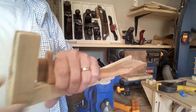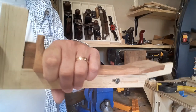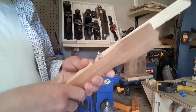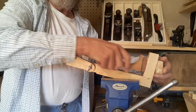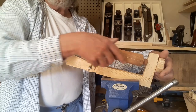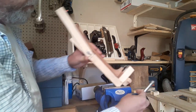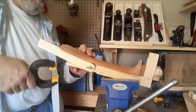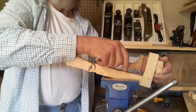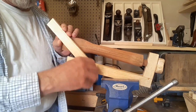Clamping a neck so that it can be shaped can be a challenge, especially when the neck is very short, so I came up with a way that seems to work pretty well. There is a short video about it and there will be a link below. In this case I'm making a bolt-on neck, so there's already a threaded insert in and it just bolts onto the jig very easily. If you're joining with a dovetail, you might be able to use a screw or put an insert in, and when you're done, dowel plug it — or it probably wouldn't hurt to just leave it in. You can turn the neck in almost any direction and clamp the jig into the vise in almost any direction. The spring clamp firms up the neck to the jig and takes some stress off the insert, which is the only point of contact. I think there's room for improvement in this simple jig, and if any viewers have ideas, please feel free to share them in the comments below.